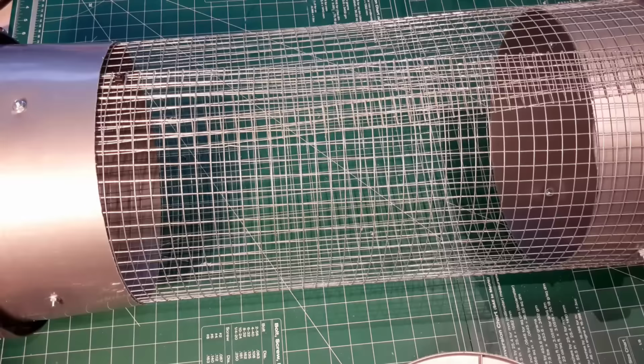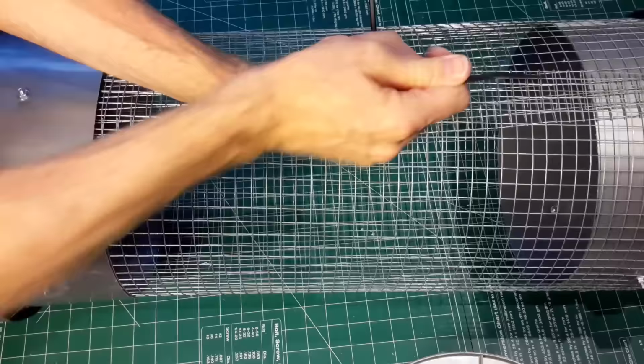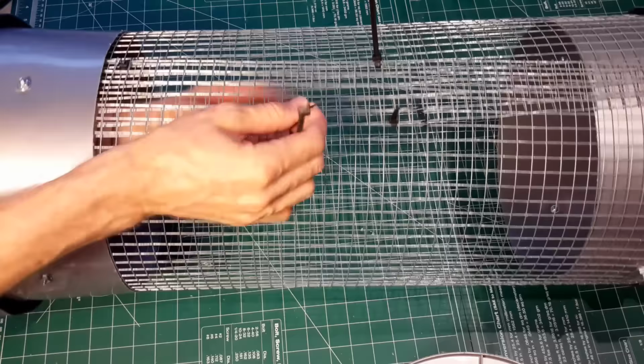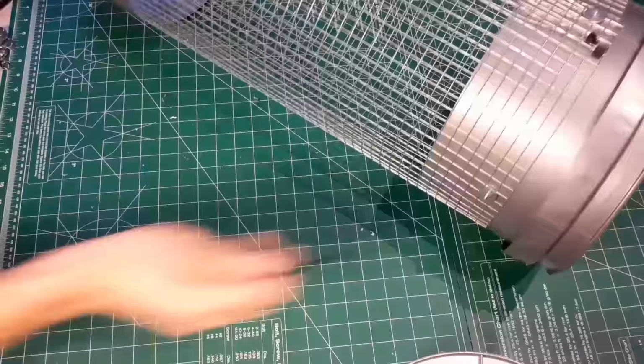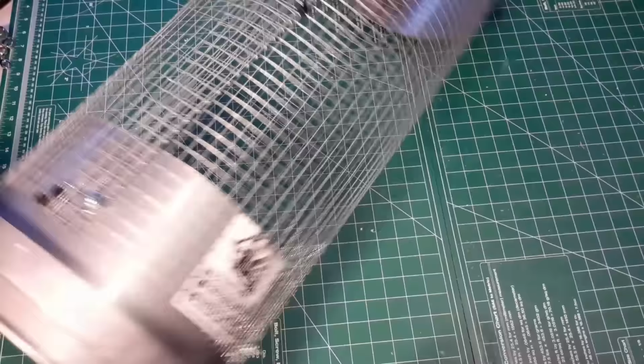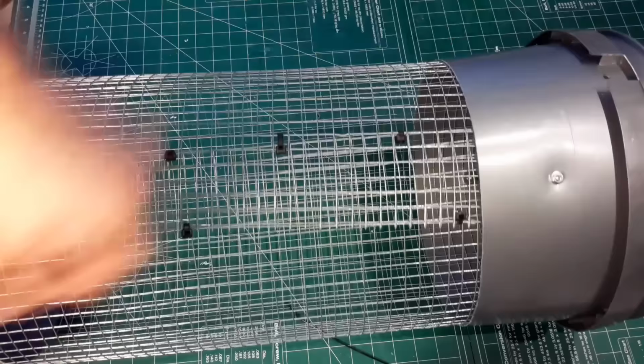Once the screen is attached to the bucket, go ahead and grab some more zip ties. Again, these are 8-inch electrical zip ties. I chose black because it's UV stabilized and should withstand constant use out in sunlight. I'm attaching to both loose ends of the screen so that it does not have any possibility of trapping debris on the inside nor hitting the structure on the outside of the frame.